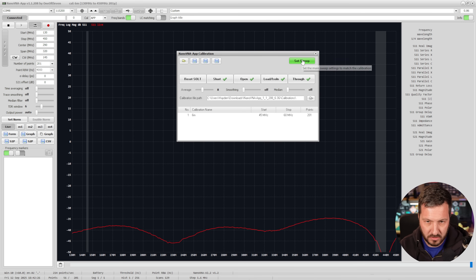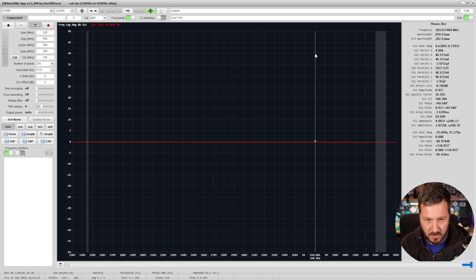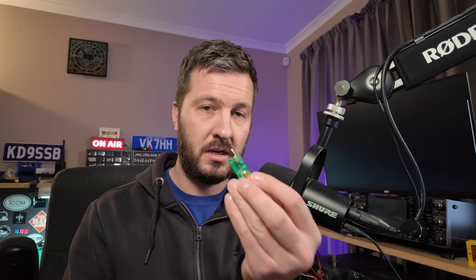I could have used a connector with SMAs since I'm going to need adapters to connect the SMA to the board, but I don't think it's going to be that critical — I just want an overview of what this actually looks like. Now that we've done that, we can set the sweep and disconnect our cables. There is a link in the description to a free cheat sheet for the Nano VNA that lists things I've put together to help with these kinds of measurements.